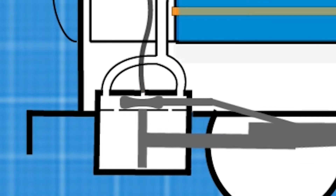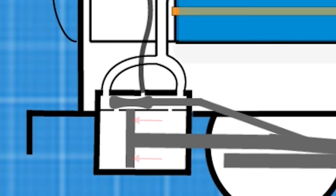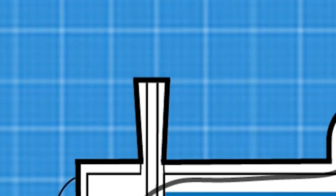The steam goes through this spool valve and pushes the piston. In turn, with a special bunch of linkages, it turns in the other direction, making the wheel go round and round. The excess steam from the cylinders goes into a pipe that leads to the smoke box, which releases the steam from the pistons and excess smoke from the firebox. This then shoots out of the funnel into the air, causing the famous chuff noise.